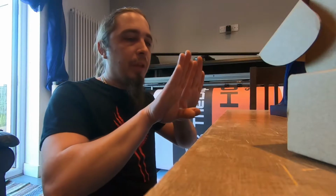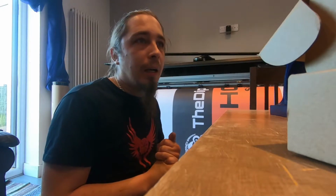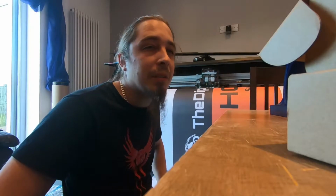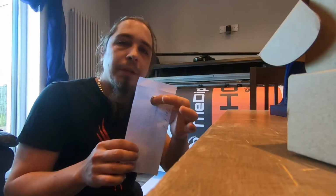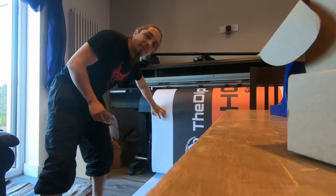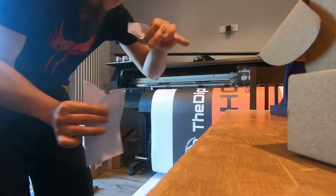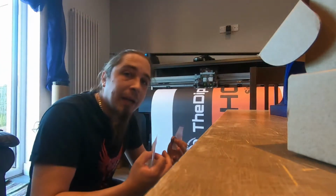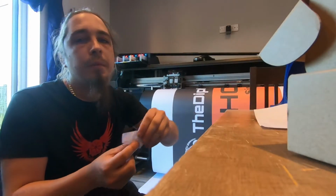Because obviously if you build them of four elements like that, then there's quite a different calculation. But as a rule of thumb, if you do them every 60 centimeters, and they're not really massive, there's nothing wrong with that. And if you're afraid that nothing is holding on, you can always try this. All you have to do is attach a zip tie to this in your material. Just take a little piece of the material, or a cut off, like I have here. I would do the eyelet, attach a zip tie, and try to hang on it and see how easily it breaks, if anything breaks, and so on. So I would just be trying that and looking at how things work.